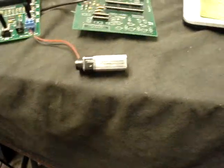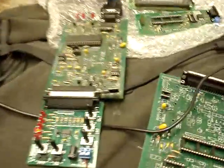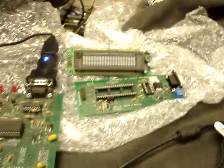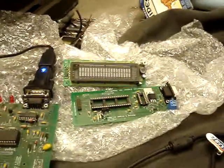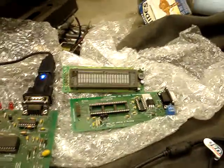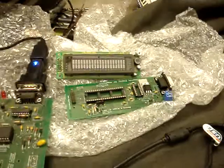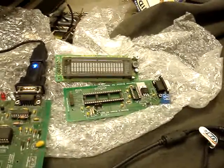I'm also working on a 1990 Suburban with throttle body injection. I picked up this Megasquirt — it's a DIY standalone computer. There's the first completed unit that I'm actually bench testing right now, and that is a vacuum fluorescent display that will let me change constants on the fuel table while I'm driving, without having a laptop hooked up to the truck.